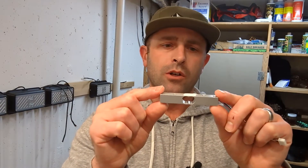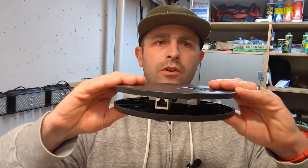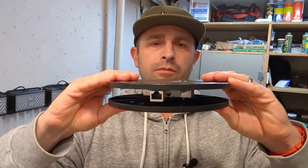Here's the main component, it's called a load cell, and they're very sensitive sensors. So once you get your scales assembled, don't overly flex them or squeeze them, don't place your plants on them, don't drop the scales. They're rated for 2000 grams, which is about 4.5 pounds. They're really sensitive, so you want to take care not to abuse them.